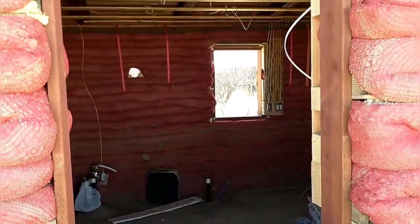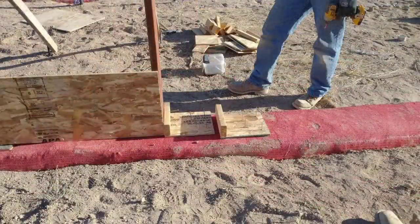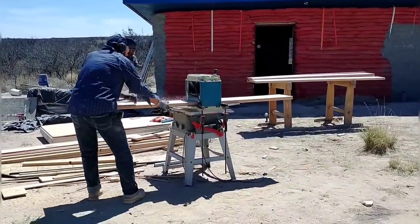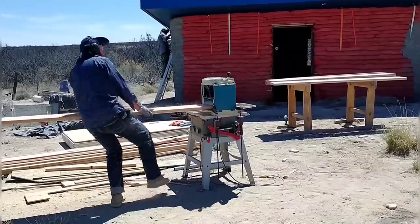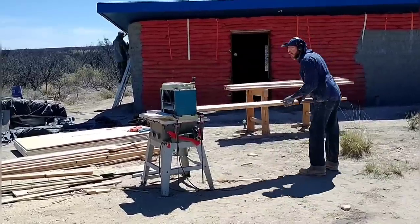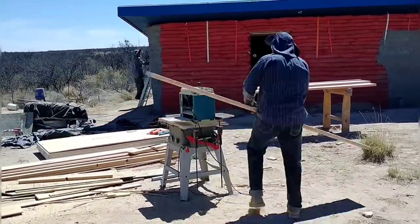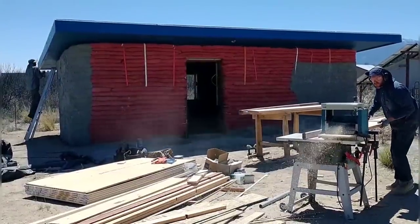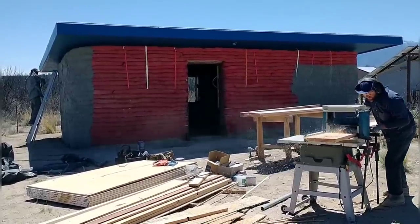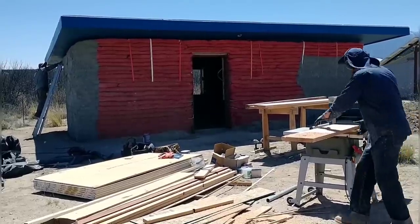Next, we're moving on to framing out the window and door openings. We started with a treated lumber two-by-eight frame that Kyle stood in place, then used cleats to attach the earth bags to it as he built the walls. I decided that probably wouldn't be strong enough by itself to hold the weight of the bags above, so we added a two-by-ten for extra support, and on top of that a piece of OSB so it would stick out the full width of the bags and we wouldn't have the bags sagging over. In retrospect, we should have built a lintel wider than the door opening itself to distribute the weight of the bags above onto the bags on the sides. But we think it'll be fine — there's not a lot of bag material on top of the door, and the roof beams land to the side of the door rather than directly on top.